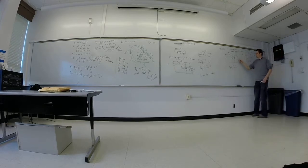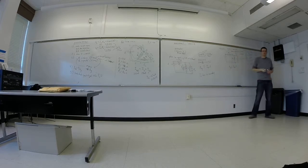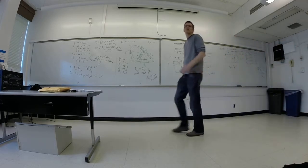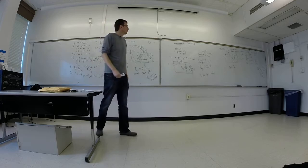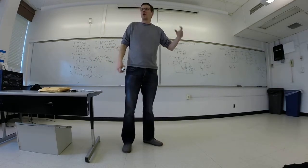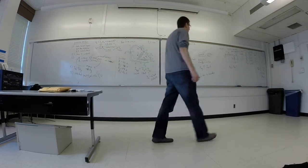So when I add the voltmeter, what does it do to the resistance of this section? Decreases it. So the voltage drop across this section is actually going to decrease, and the voltage drop across resistor 1 is going to increase. I've changed the ratio of the resistances in series. It used to be R1 in series with R2. Now it's R1 in series with a new resistor, the R2 voltmeter combo. And since that's in parallel, it lowers the resistance of that.